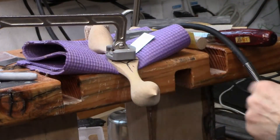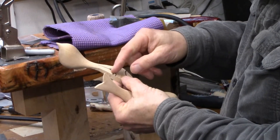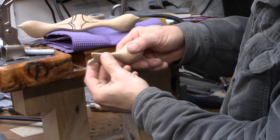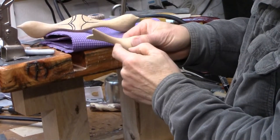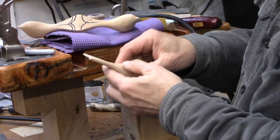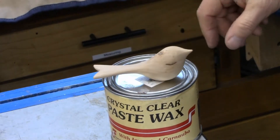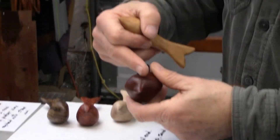The next step is to cut the tail — you finally don't need that handle anymore. Cut it to the final bird shape on the bandsaw, or use a coping saw. Then go back to the 36-grit sanding belt and lay it down to make the taper — thicker at the body, fairing right in, and tapered toward the end. I try to get it balanced so when you set it on a surface the tail floats up. If there's too much weight on the tail it'll sit flat, but I like a bird that drifts with a touch.